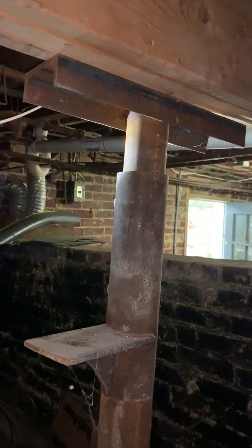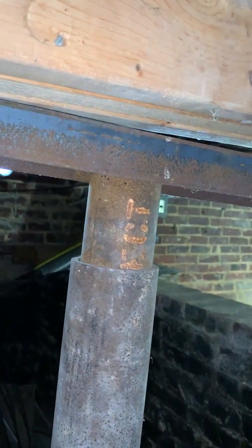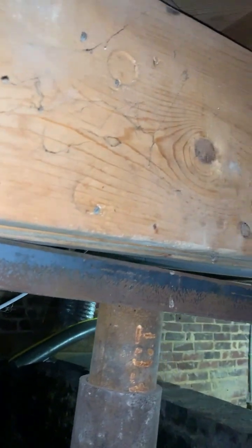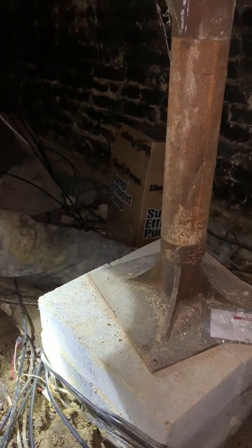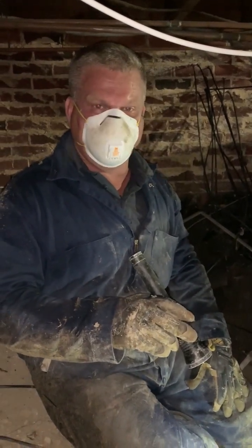It's barely, as you can see, if you look over here, only part of that steel beam is holding this drop down girder. And if you look up above, even before that, we have a gap between the drop down girder and the floor system. Everything else looks good, except it just wasn't put on a solid base. When you dig a hole, you probe the ground to make sure it's solid, and before you put these blocks, or what I'd recommend is concrete.